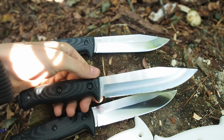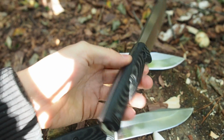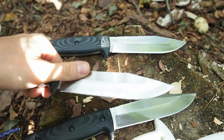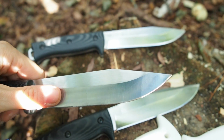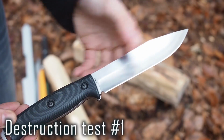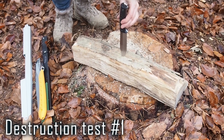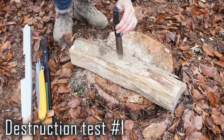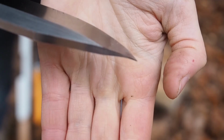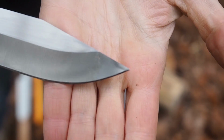And I have to say, I was really disappointed when I got the knife. It looked so much better on the drawing that I made. The handle was far too thin and too short. And the knife came with a hollow grind, which is good for cutting, but for knife stability, tip-wise, it's not good. As you can see, I have bent over my tip. Tip test with the Prototype 1 hollow grind. Bent tip after just one try.